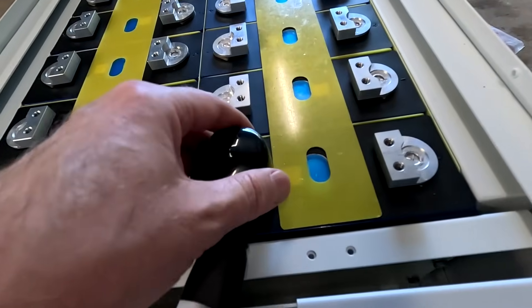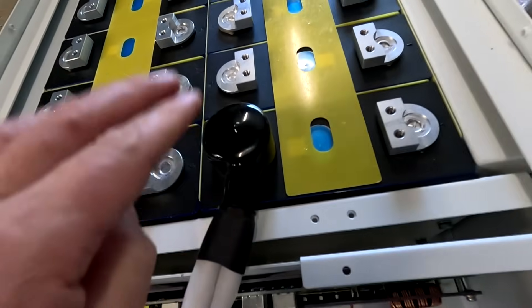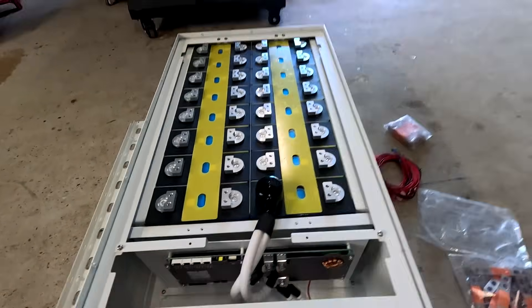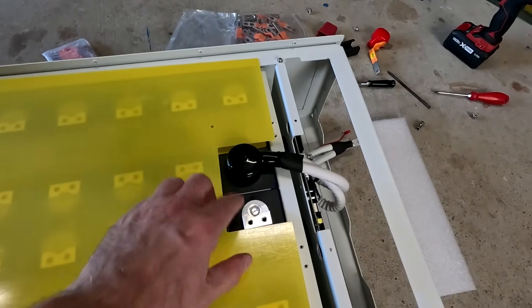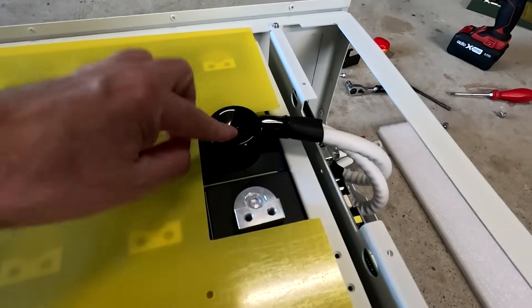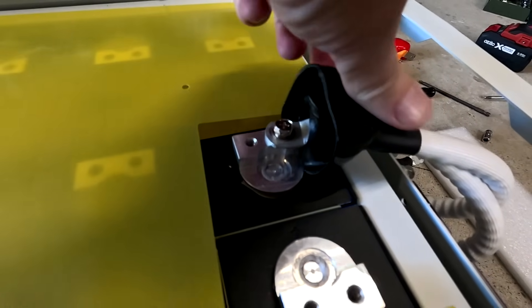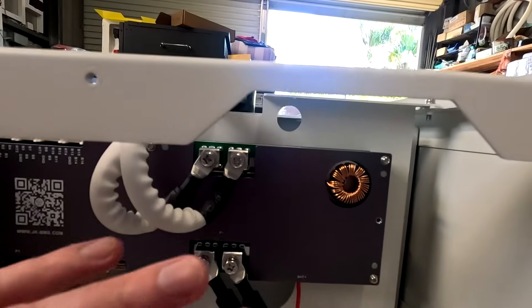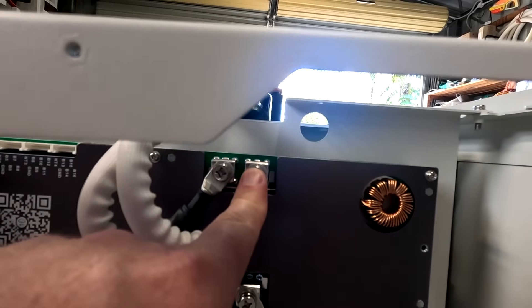I've also seen in one of the pictures — this is what the rubber protectors or covers are for. They come on here, which I really like, because the overall epoxy sheet leaves the positive and negative free of your battery, and this one actually covers it against the top lid. So this is a good solution. You can pull this one back, tighten the nut, connect the other side. Slowly we are turning all the negative stuff into the positive. Before we mount the front panel, we have to tighten and torque these two screws here for the terminal of the BMS.